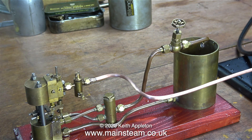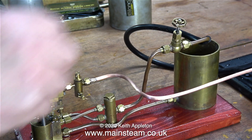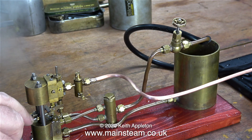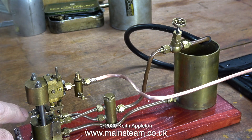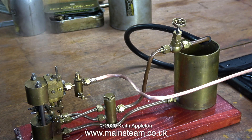This is a very early version of the pumps that Don English makes, and it has two exhaust outlets not fed into a collector, so steam goes everywhere. On later models there was an exhaust collector, which was better. In this clip I've got the valve fully open and I've connected a piece of silicone rubber tubing from the outlet pipe to the inlet of the water gauge's blowdown valve, but this pump seems to have insufficient power to pump water into the boiler against boiler pressure.